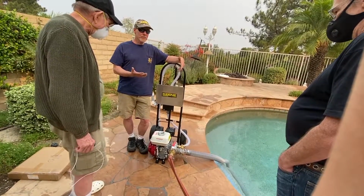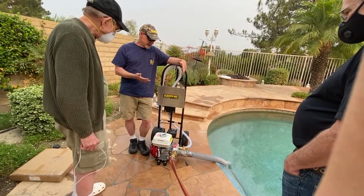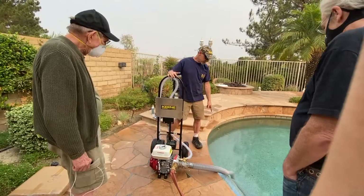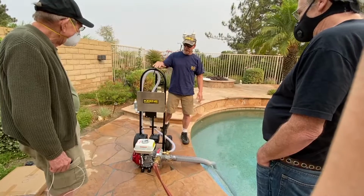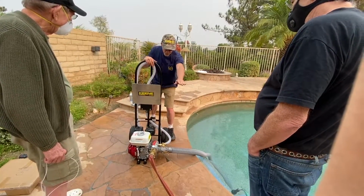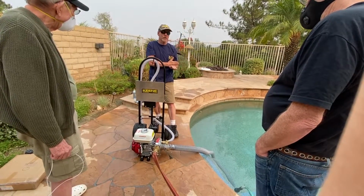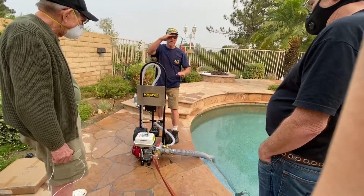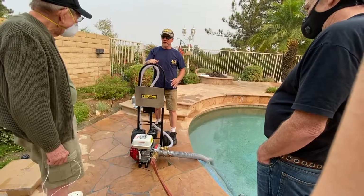Another method, you told me before, right? There's another method too: you take that foot valve, and since there's a check valve, you can put it underwater, and thrust it forward. Every time you push it forward, it fills that hose up, and when you pull it back, the water stays. You keep doing that until the entire pump is full of water. Once it's full of water, then you're primed.